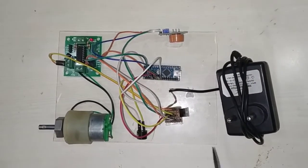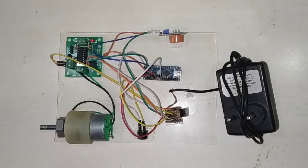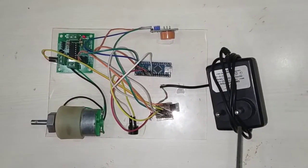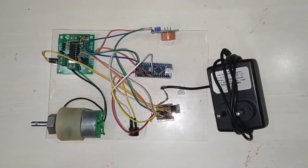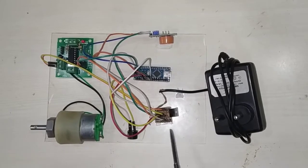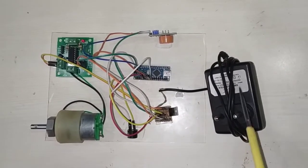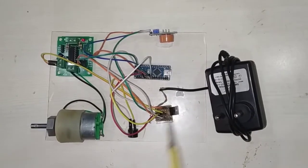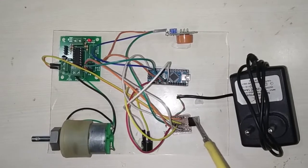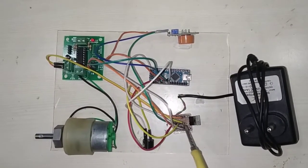As I mentioned earlier, the Arduino Nano wants only 5V power supply, but I am using a 12V DC adapter. So this output voltage has to be regulated to 5V, which is why I am using a 7805 regulator IC. The 12V input is connected to this power junction, and the IC gives an output of 5V, which I have taken as the 5V supply and ground.